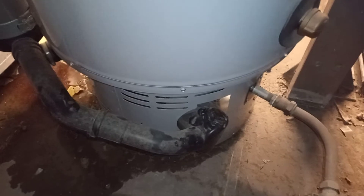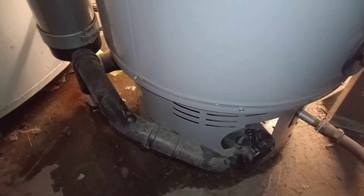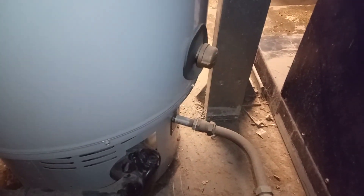Going to carry out a CP15 for this installation and leave my printout on the unit itself. Remember to check your flue, your air, your gas, your safety devices, and your 26.9 checks. Okay, until next time.